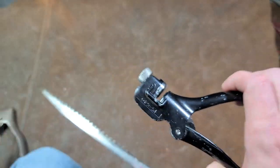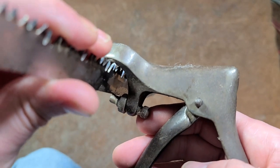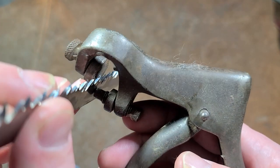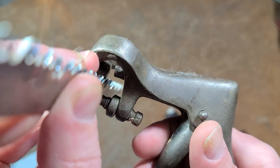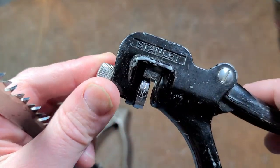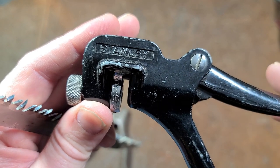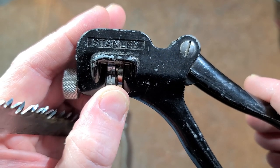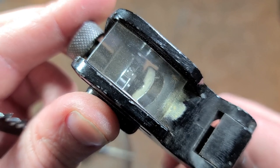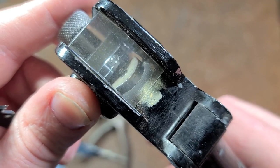The other thing about it being double-action is you put the blade in — the back of the blade hits the stop, the middle of the blade rests against the anvil — and when you press it, a plunger bends the tooth over. What's interesting about this one is instead of just a three-point system, it has a main plunger and an outer plunger that grips the bottom of the blade, and then a second inner nub that's the actual part bending the tooth. So it clamps the blade first and then bends the tooth.